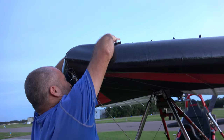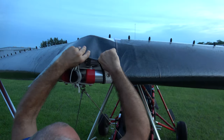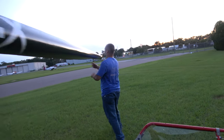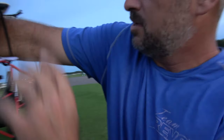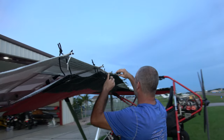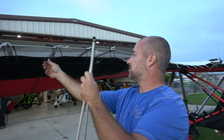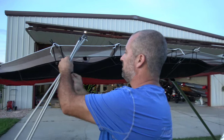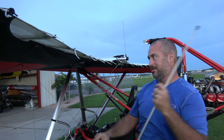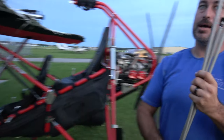I'm going to go ahead and remove the nose cone — we can tuck it into the leading edge, and this is where it'll stay for the trip. Now we're going to remove our tip battens and disconnect the bungee cords. There are a lot of battens on these double surface wings — that's why people ask why it takes so much longer than the quick fold wings. With quick fold wings, you're pulling out seven battens; with this one, you're pulling out about 40 battens.